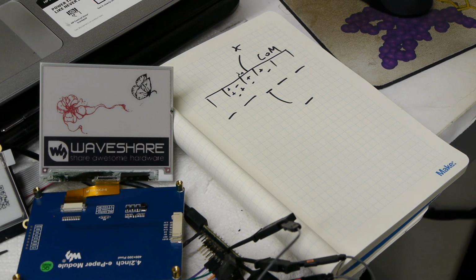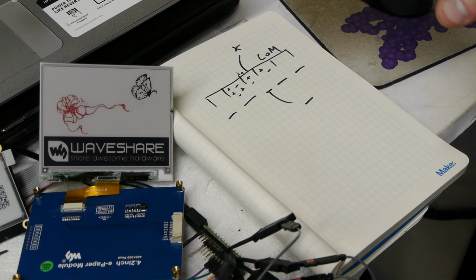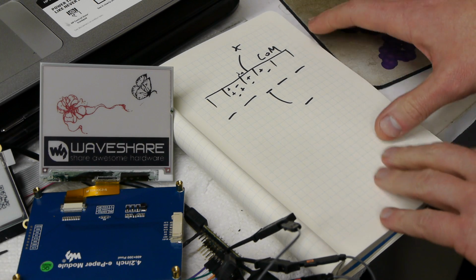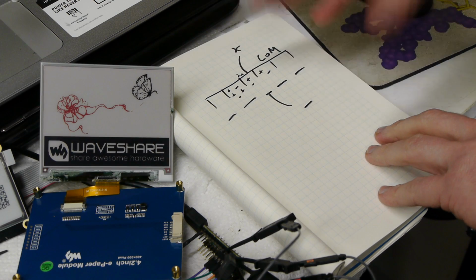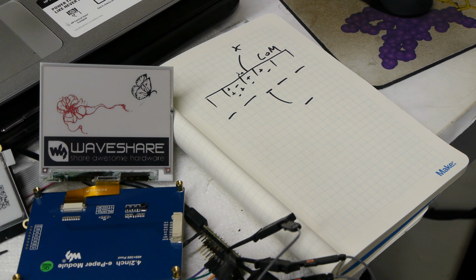If you search around on e-paper distributor sites, you'll see that some of the newer displays are actually rated for what they call partial refresh. So basically doing this without any flashing or flickering, get a new image on the screen without any of that. And I think the trick is they've basically just loosened the usage restrictions. And so they're saying, okay, you can bend the rules a little bit by putting just a DC voltage on there to get a quick update, but then you better do a full refresh at some point in the near future. And I think the reason that it's hard to find instructions on how to do this is because they know that you're going to degrade the panel's performance if you don't have the right routine. So it takes a little bit of experimentation to get all this working.